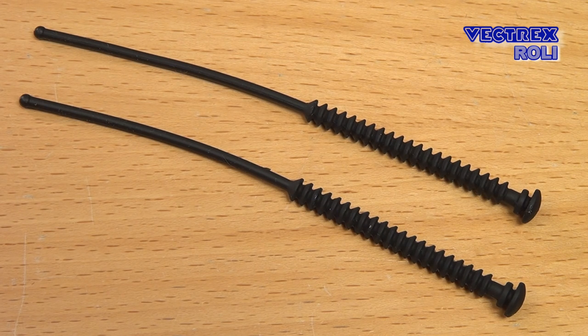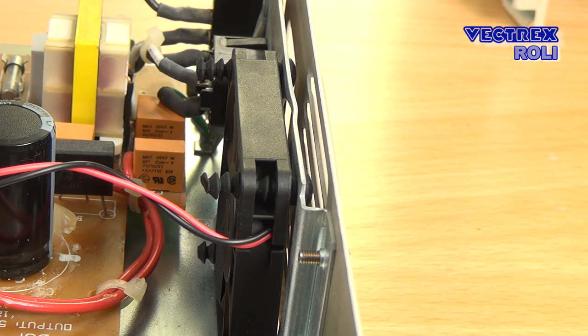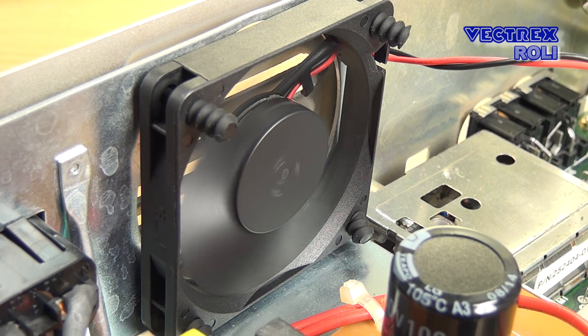The idea is that the running fan does not directly touch the metal case, and this helps again to reduce noise. There is no time here to discuss all the different bearing systems you can find in modern cooler fans, but long story short, if you can afford the additional 10 to 20 bucks, just don't buy super cheap no-name fans from China. Usually they will get noisy after a short period of time. Even I used a slightly more expensive Sunon fan running at 7V instead of 12V, and even using the silicone holders, you can definitely hear the fan running and it does generate some noise, which is not really a problem for me, as it is likely that this will increase the lifespan of my machine.